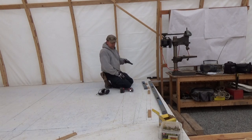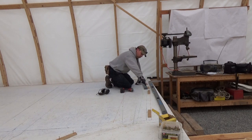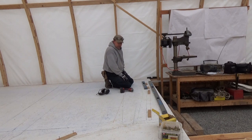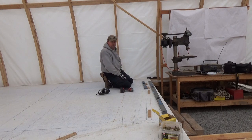I don't want to bore everybody with the repetitive nature of building these frames because they're essentially the same as we go, but this one is going to be a little different. The ones towards the aft end of the boat are going to be a little different because they have the raised shear — this crook where it looks like a normal dead rise on the side, but then there's a shoulder where it angles up in a straight line. There's a different way of assembling these frames because we're actually going to have to trim off the side piece at an angle, and then that cutoff will be reattached on the inside and bolted on to give a squared-off inside edge and to allow for some thickness there for strength. So we'll go through this one and see how it goes.